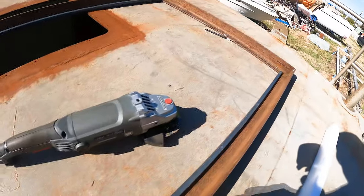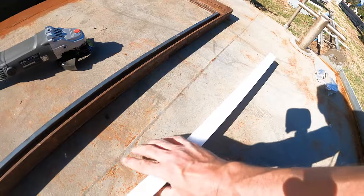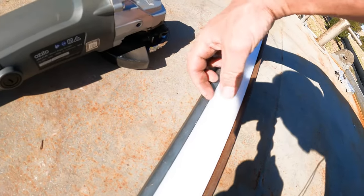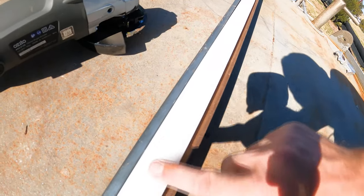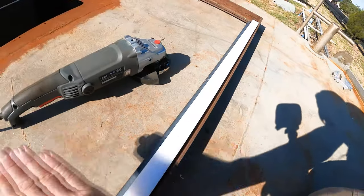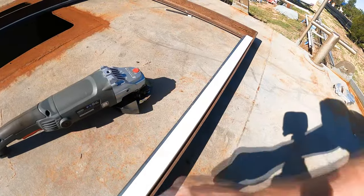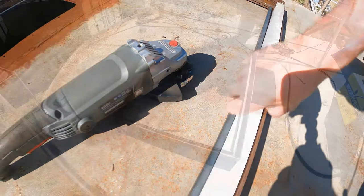And then once that's all welded up, it'll be another time, but eventually I'll cut this down, and this is going to sit inside there. We're going to cut it into multiple strips, so it's obviously not going to be this big, and then there'll be a 10mm slot routed in the middle of this, and that's where the runner for the slide will run back and forth, and that will keep that slide running parallel. So that's going to work out nicely.